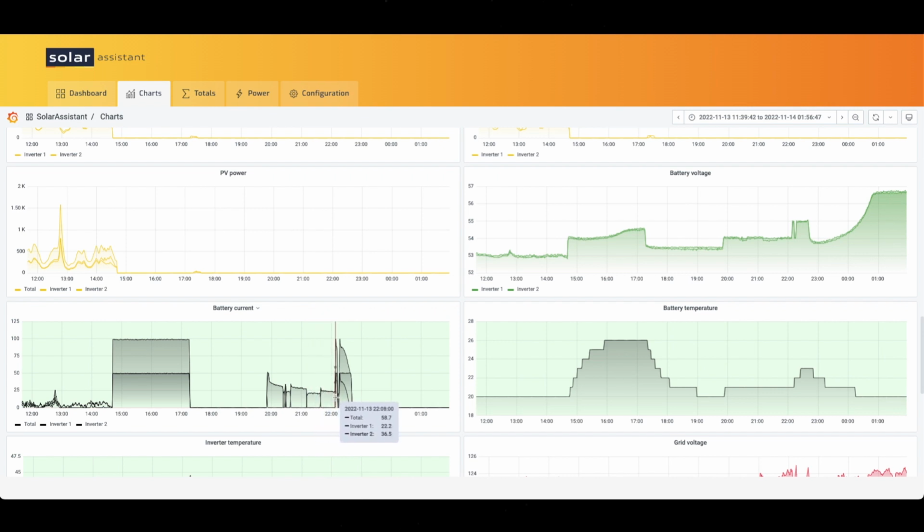And then over here, now you can see where I switch the float voltage. Now both of them are starting to pump in. Still not exactly the same amount, which again doesn't make a whole lot of sense to me because they're in parallel. They should be in communication.